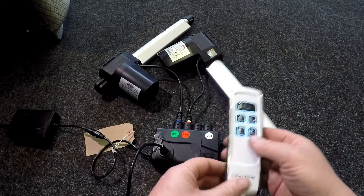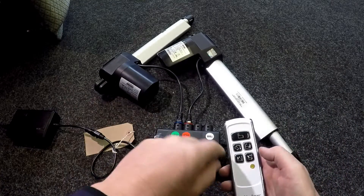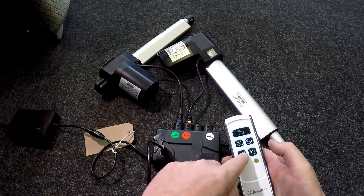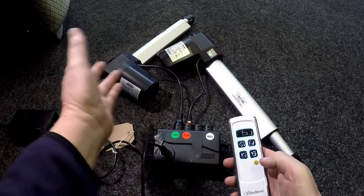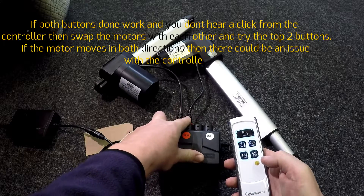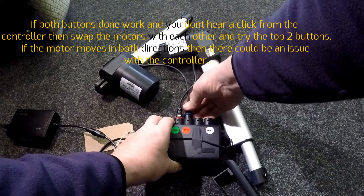That's quite easy — we have these in stock. If that doesn't solve the problem, check all your connections again. If you've checked all that and it still doesn't work, here's what we can do: we know these two buttons work. The other motor works in the up position but not the down position. So with the chair on its side, I'll take this connection out of the controller and put it in the other connection, and vice versa — swap them around, because they're all exactly the same. Pull it out, put this one in here, and put that one in here. So all I've done is swapped everything around.